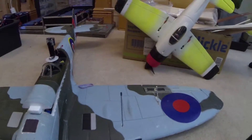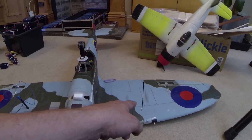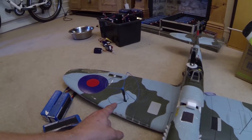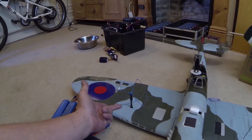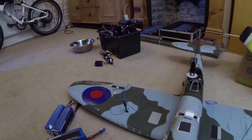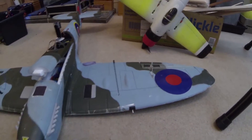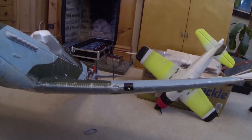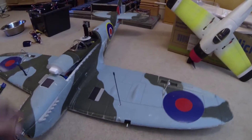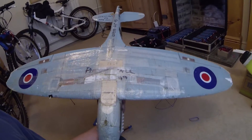So that's the top. It runs on Easy UHF — that's the 433MHz antenna there. For video it is 1.3GHz, and that's a cloverleaf three-element aerial. With the MFD autopilot it's got airspeed sensing on it. Annoyingly, those tubes snap pretty much every time you land — they're really brittle — but this one's short so it doesn't snap now.